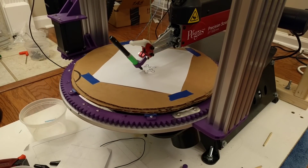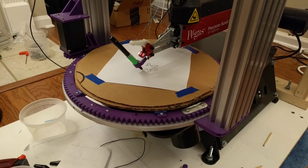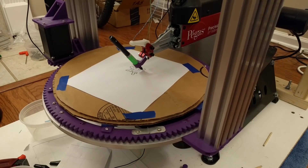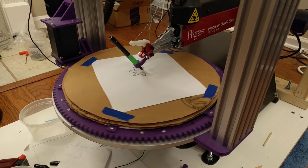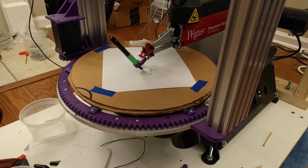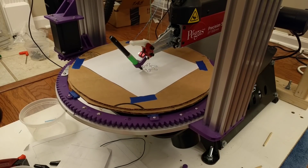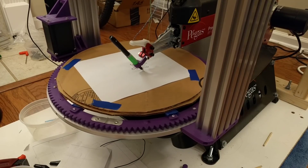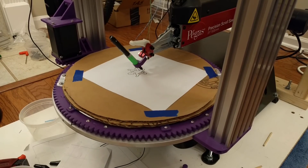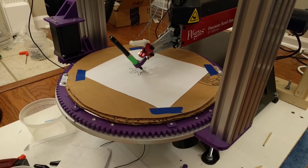I went through a few different motors to control the rotary axis and settled on using this high-torque NEMA 23 motor from OpenBuilds, driving it with 64 microsteps. This gives enough smooth motion at low speed, since a lot of these movements are less than a degree and can happen very slowly, but we also need to be able to rotate the entire platter back and forth very quickly, especially as you get further away from the center of the workpiece.